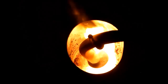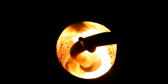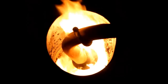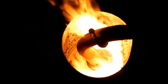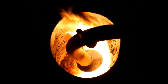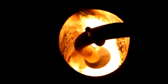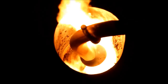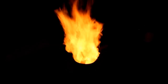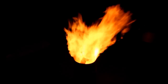The other thing you might notice is it doesn't have any build-up. It runs really nice and clean. I never have to clean these burners no matter how much oil I put through them, unlike other designs. I think that's due to the air turbulence and the fact that they run pretty hot and always burn with an excess of air, so they burn very clean as well. As I said, this one only cost me 20 bucks. I have seen them range in price and you can get bigger ones.